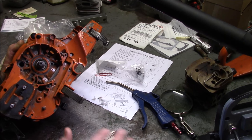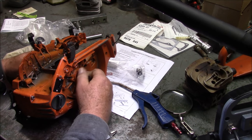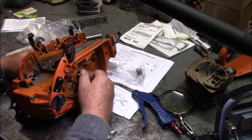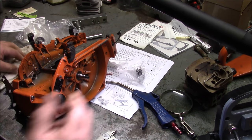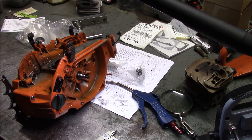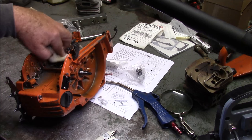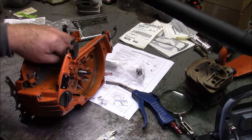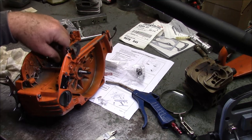The reason I'm taking this apart is: even though turning the crank feels kind of smooth, there were some metal chunks that were coming out of that crankcase. That usually means something has failed on the bearing or something like that. And even though it turns smooth now, the fact that I've got those metal pieces out of there and there's nothing in the piston or the top end that could generate that means either something was ingested, or something is failing in the crankcase itself.